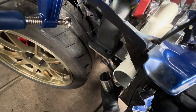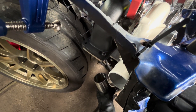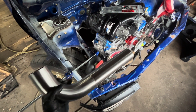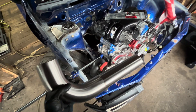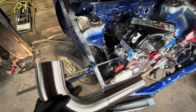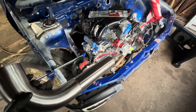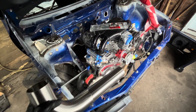We're going to stick it in here and check it on our flange with the 45 and see how much we have to take off this end — looking like about half an inch to an inch. The reason for making this piece first is so that once we get this length right, we can stick it in the V-band and cock and turn this whole thing to get the right angle and position. If you start with just the straight piece tacked onto the V-band, you're holding the 90 up against it and looking at the 45 — it's just more cumbersome. Having this whole piece held in place, just sitting in the lip of the V-band, makes it easier because you don't have to worry about keeping anything lined up on that end.